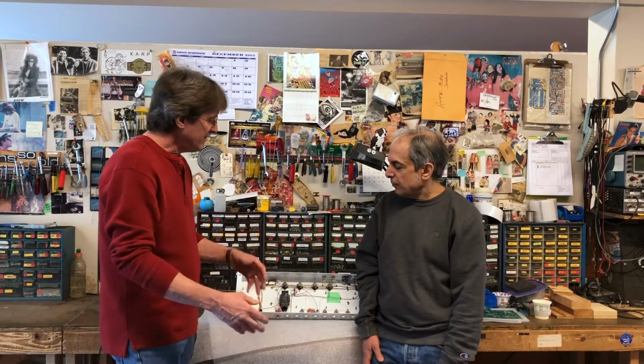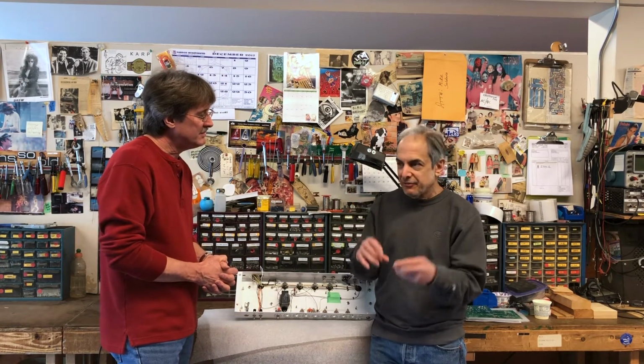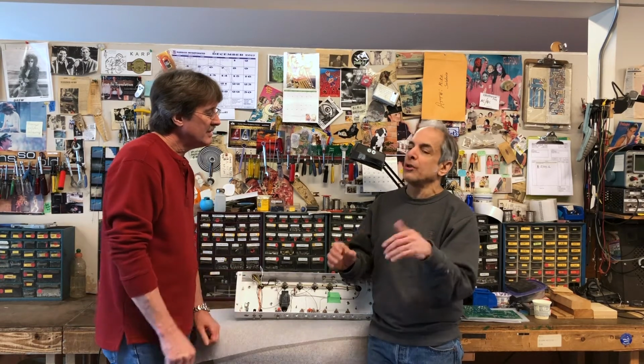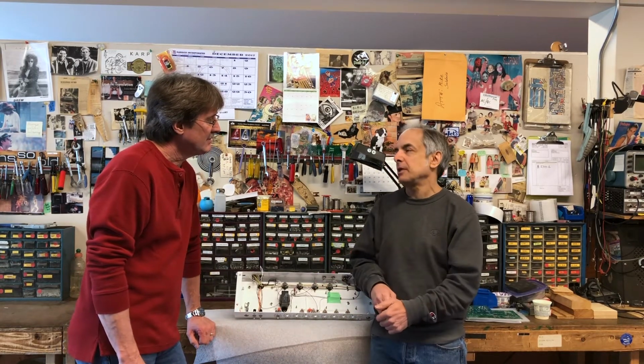Most of these guys out there may have old vintage pedals that are effects level. Or guitar level is what they are. So they're generally older, more basic effects, at about minus 20 dB. Most rack mount effects or modern effects are either +4 or 0 dB, or they have the selectability to let you choose that. And our original loop is optimized for about 0 to +4 dB.